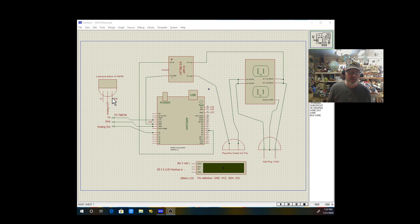I have about two feet of wire from the temperature sensor to the Arduino. For the display, I'm using a leftover 2004A LCD. I haven't used the I2C version because it uses the SCL and SDA pins, which I often need for other purposes — so this one sat in a drawer for a while. I really like the serial onboard LCDs from SparkFun or Adafruit because you can use them on almost any pin and they're very simple, but this one looks great and was perfect for this use. I got it from Banggood for about four or five dollars.